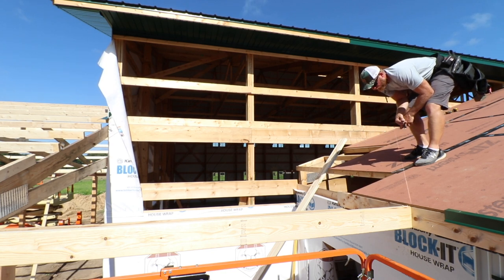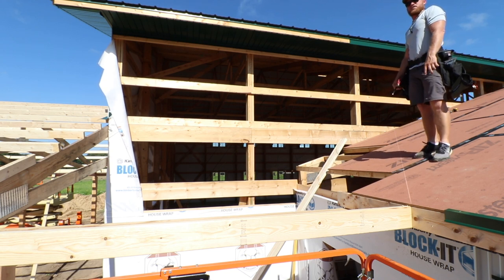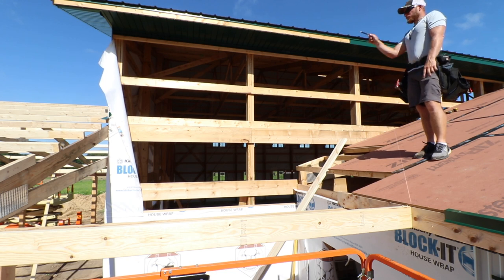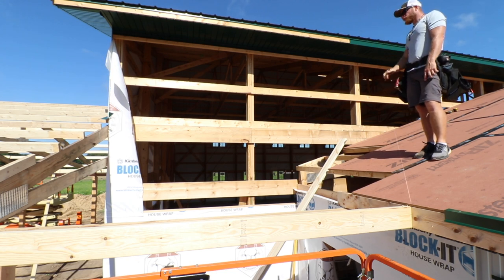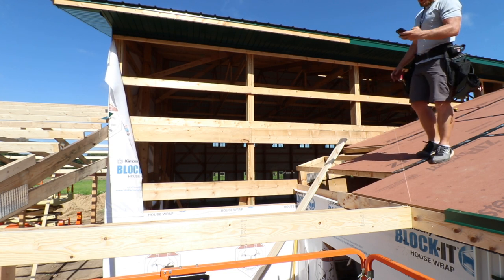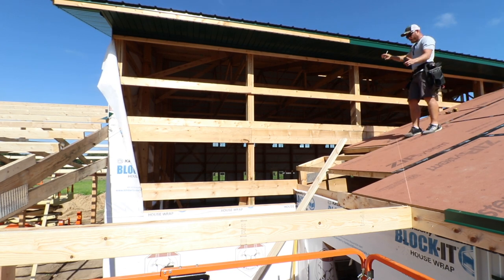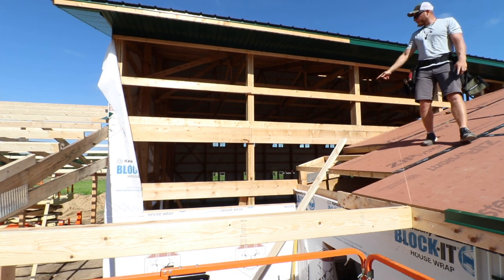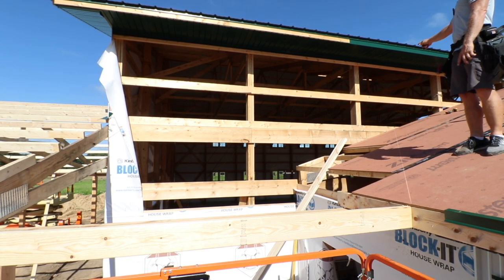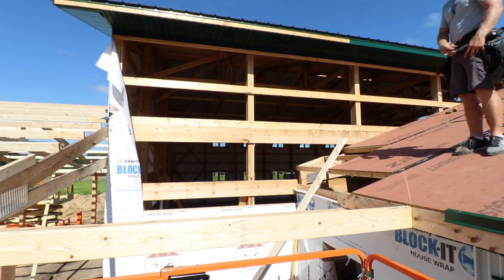I just got to put a 4/12 bevel on it and it should come out just in this area, and then my purlins can come right over the top of it. Pull all the way out because I've got to keep it down so my purlins come on top - my purlins are three and a half inches and they're going to run all the way. I'm going to cut my purlins - those are two-by-six purlins due to the distance - and these are going to be pitch-cut two-by-fours that lay out on this roof. Get that two-by-six up there, Zach, and it should just fit into that post there with an eight-footer.